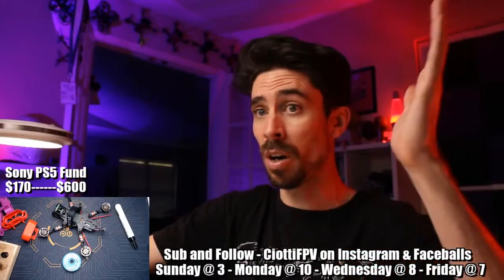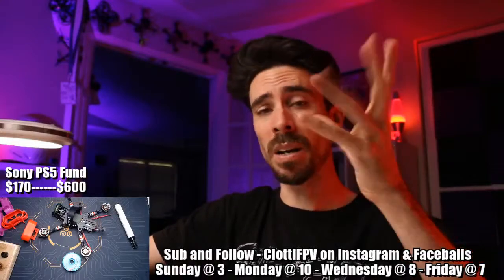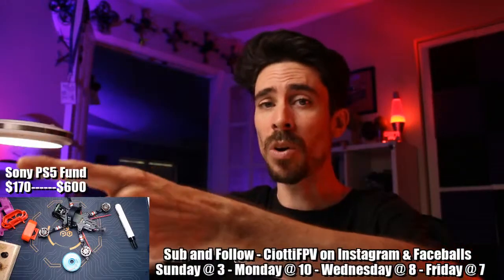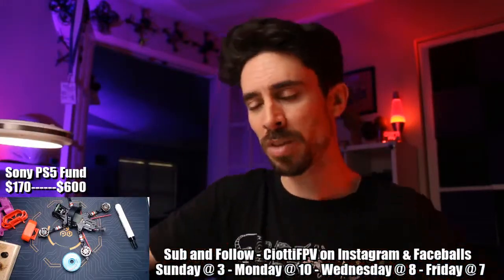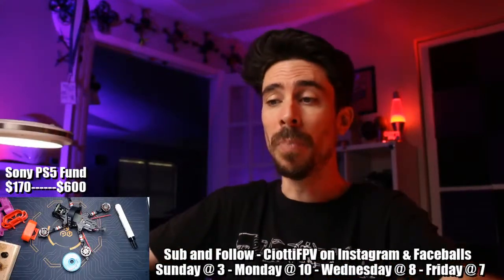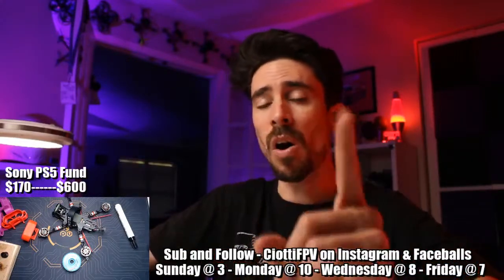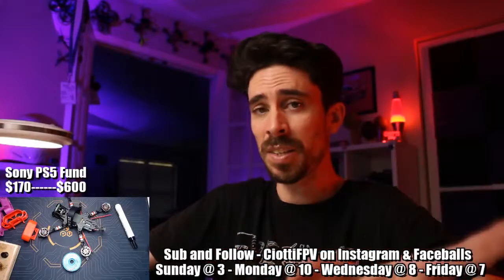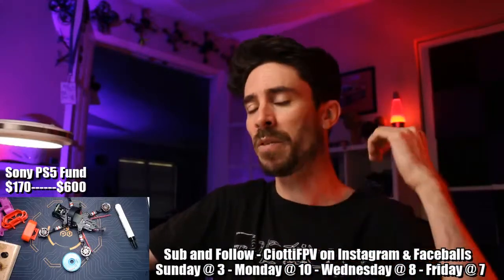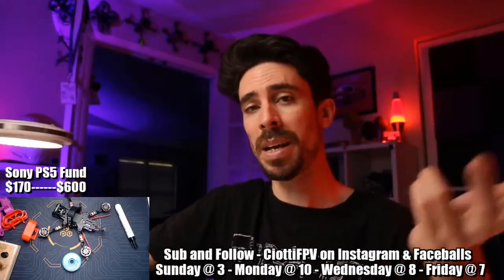The 2Fiddy is a great frame for a freestyle setup at an all-up weight of 250 to 300 grams. But if you put a big heavy camera on it, you're overloading the strength of the arms, so you're going to break arms constantly. 2Fiddies already have an issue breaking arms, but I actually prefer that. I will always take a frame that's going to break an arm that costs $3 or $4 and is easy to replace over a frame with infinitely strong arms that's going to break motor after motor after motor, which are a lot more expensive and a lot more of a pain in the ass to change out.